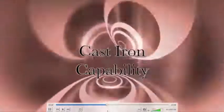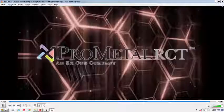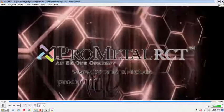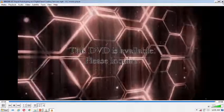So this is a conventional foundry activity that is going to happen. So cast iron, you are pouring the metal. So the casting. That is a typical example of a binder jetting process for creation of the molds and the cores, where the raw material is in the form of a powder, that is sand.